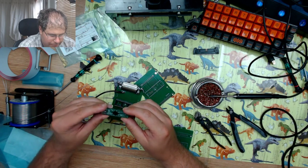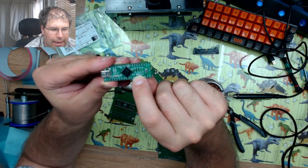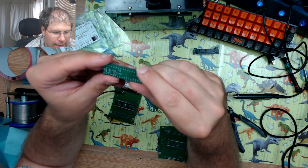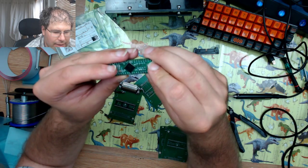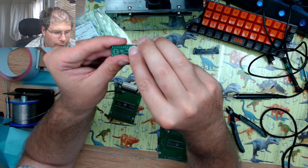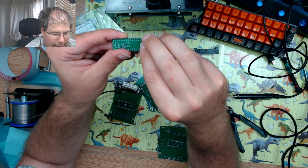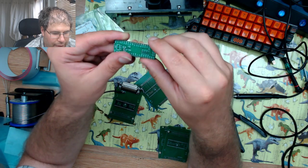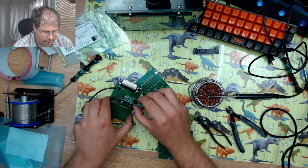make that pin usable. So on the TNC, you see there's this LED down here, which is the one that is linked to D6. On the underside of the TNC, you can see the trace running from D6 to the via, which then connects to the LED. So if you basically use a knife or some other way to break that trace going from D6 to the LED, then that will shut off the path to the LED and therefore make that pin usable. But I had plenty of pins, so I didn't need to bother using that.